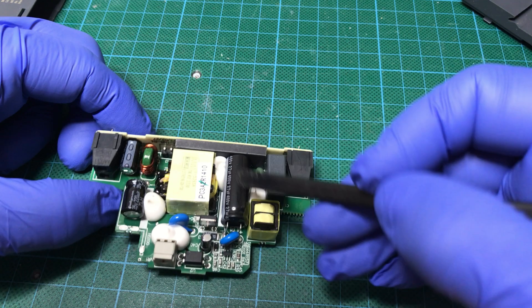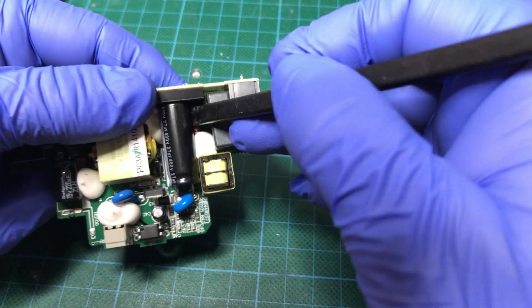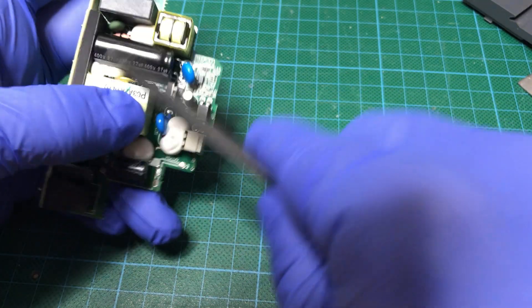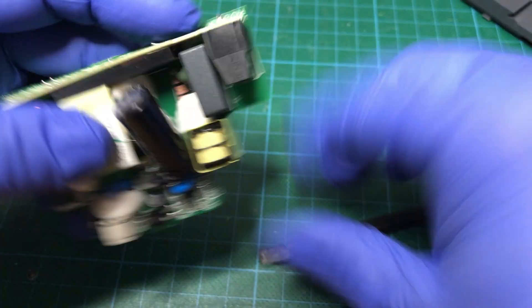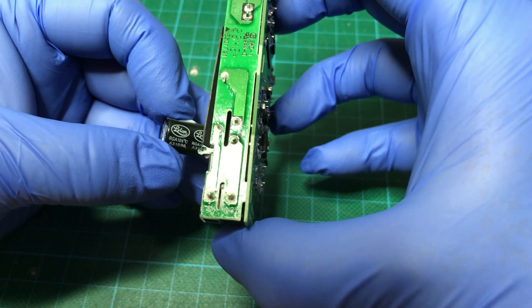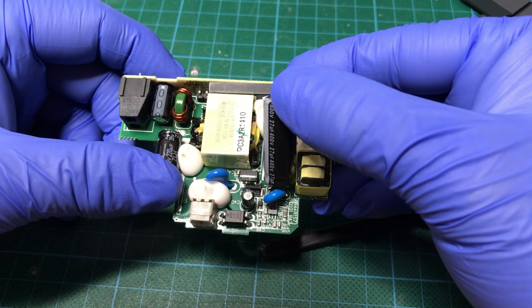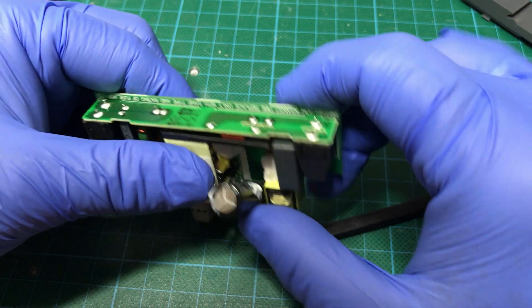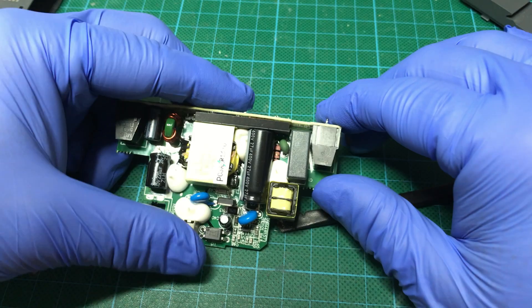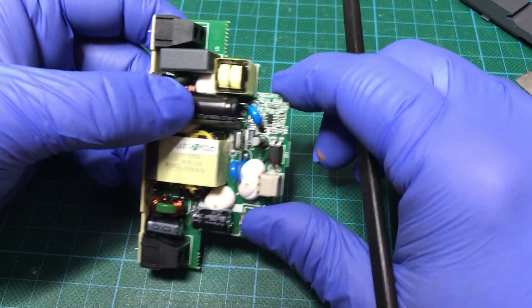As you can see, it has a 27 µF mains capacitor. I am really curious what brand this may be. And it is a Lelon RGA. These are not top-tier ones but you find them in many computer power supplies from known manufacturers, and I am pretty sure it is a 2000 hour rated capacitor. We will take a look at the datasheet.